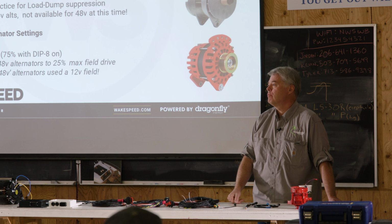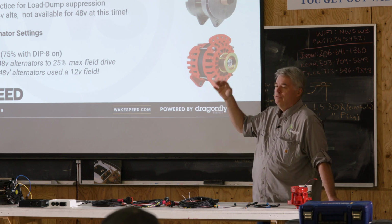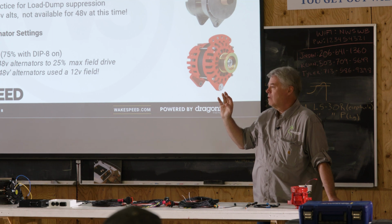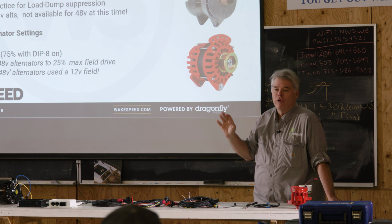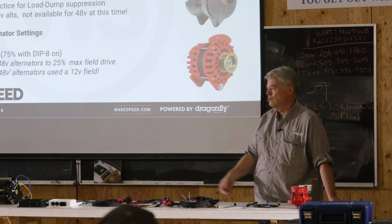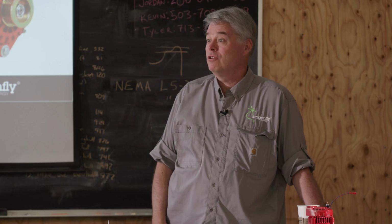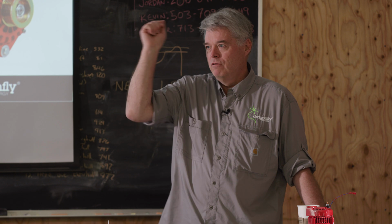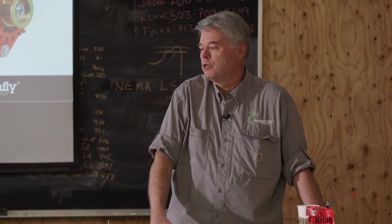What I've had some marine installers do is say, fine, normal is 80%. If you flip dip switch 8 on, we'll cap it at 50% or 60%. That's used for when the customer gets out in the field and you get that phone call that says, my alternator is overheating, what do I do, because I'm in Mexico now and it's just hot out? You can just tell them, well, take the cover off and flip on dip switch 8. That's just a little option.